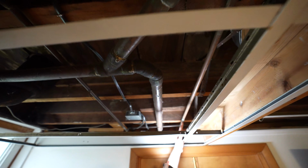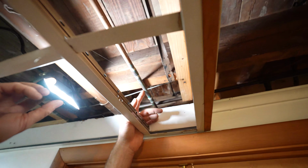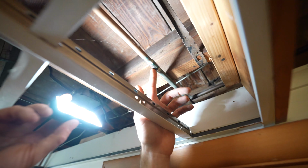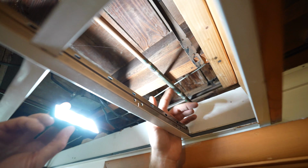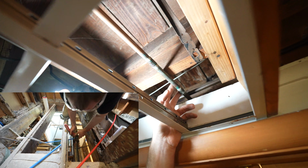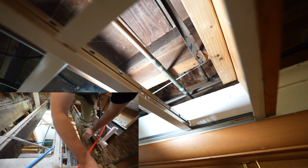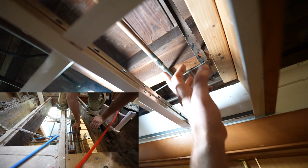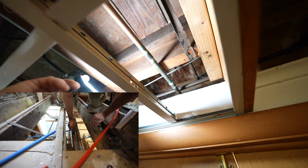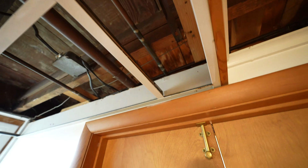But you can see even here, we got some excessive green buildup, and that is not terrible. This is probably not something I'd be overly concerned about, but PEX is a very inexpensive way to replace this. So I would go ahead and still replace this if I was advising the client. But for all purposes, since this is easily accessible, you can easily repair it if it ever needed to be done. Okay.